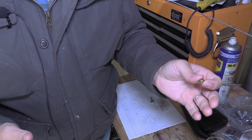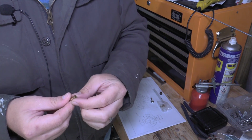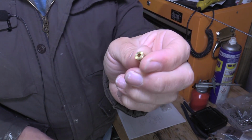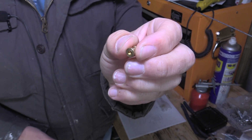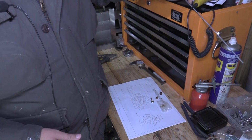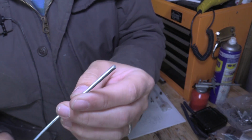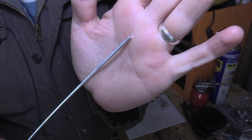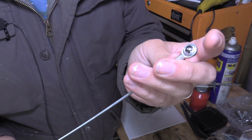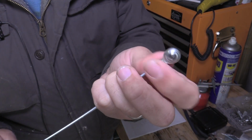Obviously, as well as steering, the rack will need to travel up and down with the suspension. So at each end of the rack there will be a small universal joint, again which I bought, and again that has a 3mm inside diameter. And then coming off those universal joints, I've just got some M3 threaded rod, which I'll cut down, and they will connect to what will effectively be my track rod ends, which are an M3 rod end connector, the female this time, not male like the previous ones.